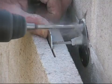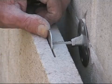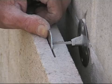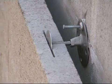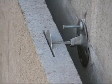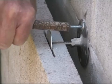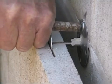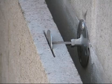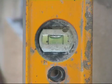If you use our method of inserting the fixing restraint into the panel and then secure it to the substrate with a bolt, pin or screw, you can guarantee that it is fixed and won't shift or dislodge, as is the case with glue or epoxy. In StoneClip's case, you will have no worry about heat, cold, sun, rain or panel bending causing release of the panel over the years. You only have one worry, and that is if you have picked the right stone for the project, as it is there until demolition.